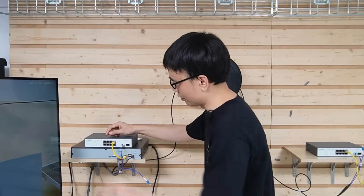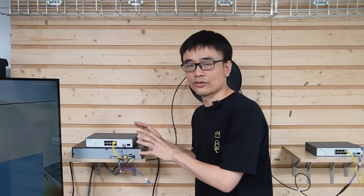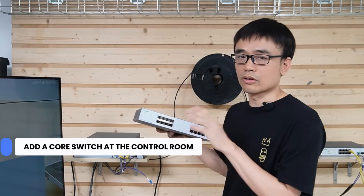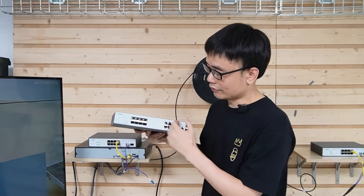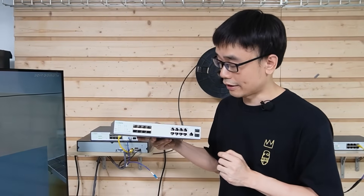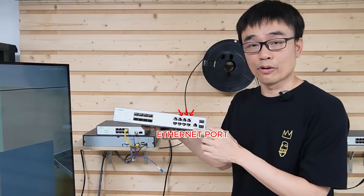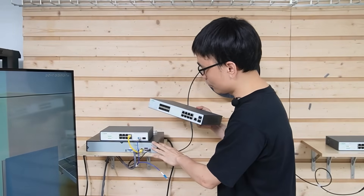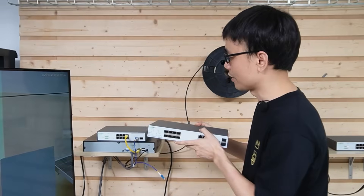But we are also quite short on Ethernet ports. We have six IP cameras, one network video recorder, and one computer. We also need to connect this switch to the router or modem for remote access to the whole system, and the client may need to add devices in the future. The solution is to add one core switch. This core switch has 10 SFP slots, so it can work with fiber optic cables from up to 10 different locations. The Ethernet ports on it don't support PoE, but we can connect the computer and the network video recorder to those Ethernet ports.